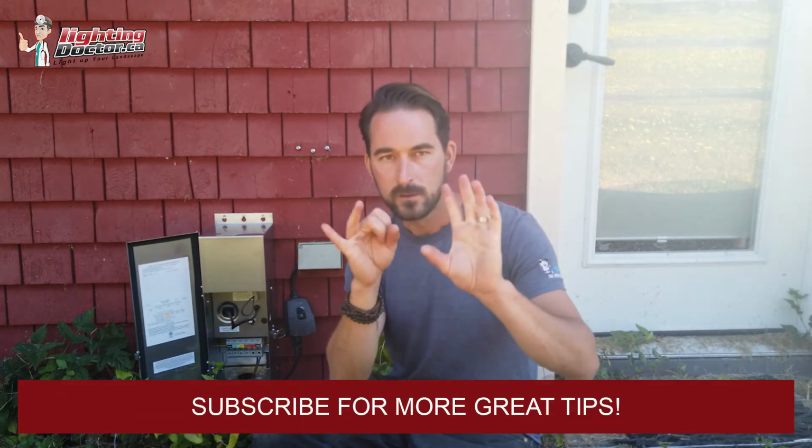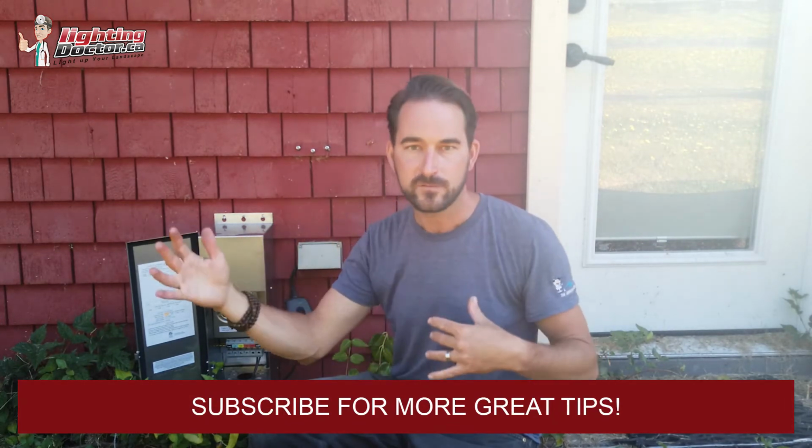If you're using a good contractor grade or professional light, you allow for maybe 20% extra of that VA. So a 5-watt light might be using 6 watts, maybe 7 watts. So always plan for that. Any of the good lights are going to tell you that. They're going to give you a VA on the box, which is going to tell you what you should actually plan your transformer for. So let's say our standard RS uplight was a 4-watt LED bulb, which only uses about 4.2 watts, but let's say it's 5, just to keep the math simple. Say we've got 20 of those lights. 20 times 5, we have 100 watts.